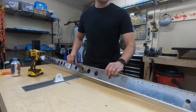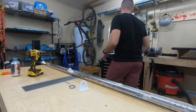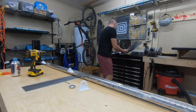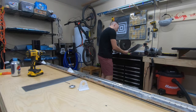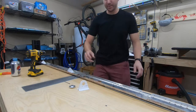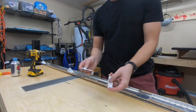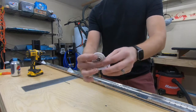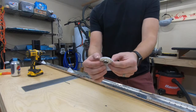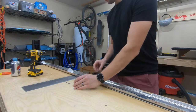This next portion here looks pretty fun — it'll be making an attachment. It looks like it's going to be page 8-3, step number one, which is putting together this flange bearing. So this flange bearing here looks like it sits between these two pieces. It's going to sit like such, and it's going to involve some drilling and then riveting this together into one piece.